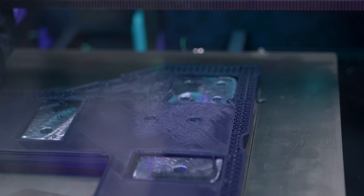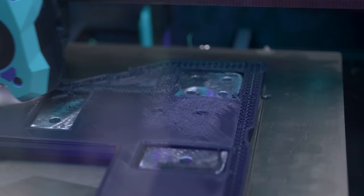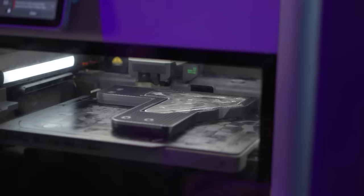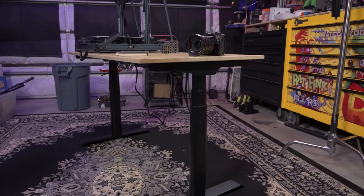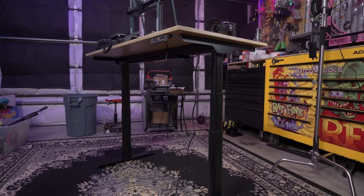I'm glad I tried embedding steel into 3D prints — that was something I wanted to do for quite some time and it worked out beautifully. It could have been a lot better and I've learned a lot for the next time, which will absolutely happen again. So maybe consider trying it out for one of your projects, and get parts laser cut — not cutting them by hand. Don't waste your time; the steel cost almost as much as the quote I got for laser cutting, I just didn't have time to wait. Thank you one more time to our sponsor Flexispot — I've been wanting to do this exact project for months and couldn't justify the time until they sponsored this video. Check the description for links to the latest deals from Flexispot.